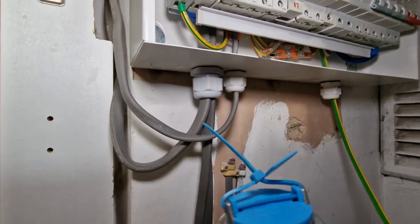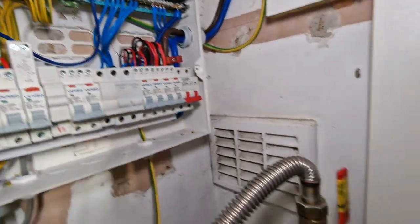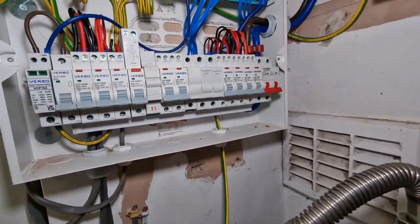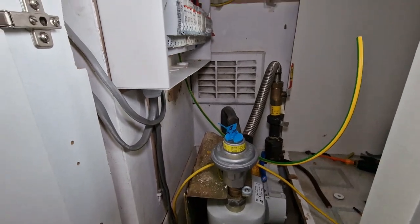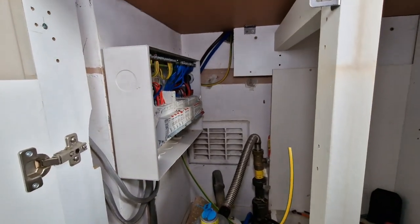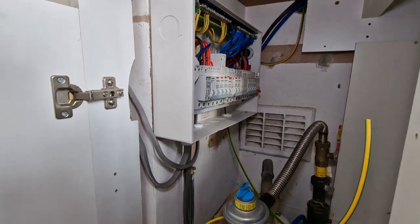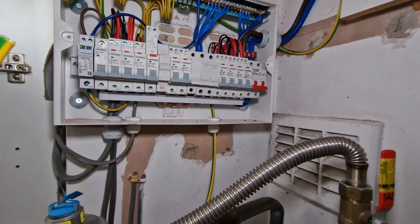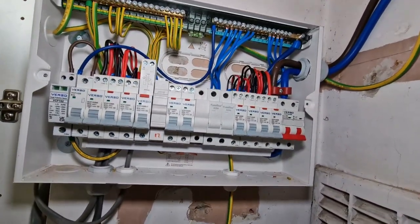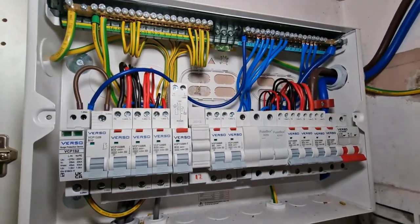There are lots of entry holes into this board - you can see underneath we've got the glands, and there are loads of other knockouts too so you've got lots of options. We're still tidying up a little bit. We've got our bonding floating in mid air and we have got a reasonable distance from the gas meter - it's as far as we're going to get in this kitchen cabinet. There's just no more room where the circuits are coming through, and we don't want unnecessary terminations. Full credit to Nathan - silver plated busbar as well.